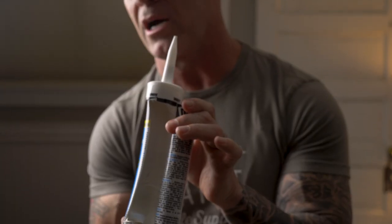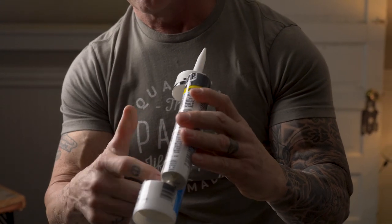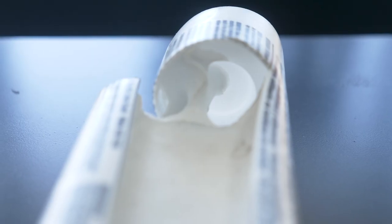I'm going to show you a tube of caulking. This is DAP — probably one of the cheapest tubes of caulking you'll ever buy. It doesn't bond well, it cracks easily, but it's affordable. Here's what we call an air bubble. These are tubes of caulking we cut open brand new — wet — and they're dried now. Here's a very large air bubble inside this tube. When you pull the trigger, it pushes on this air bubble, compresses it, and expels caulking out of the tube. That air bubble will continue to expel caulking and make the dripless gun not function.